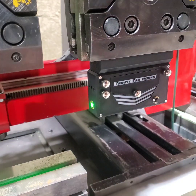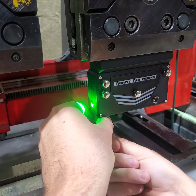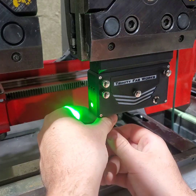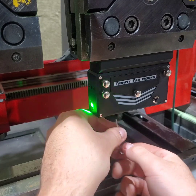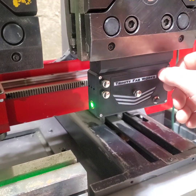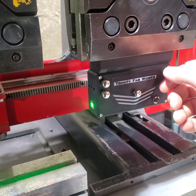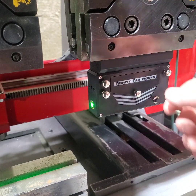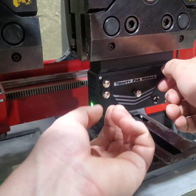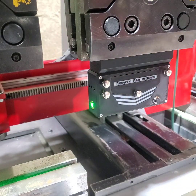Actually that looks pretty spot on right there. I'm going to lock this back down - and don't over-tighten these, they're really small and have a tendency to strip if you over-tighten them, just barely snug them up so it won't move on you. Now I can go ahead and realign my laser with the etch lines on those pieces of stainless and should be good to go.